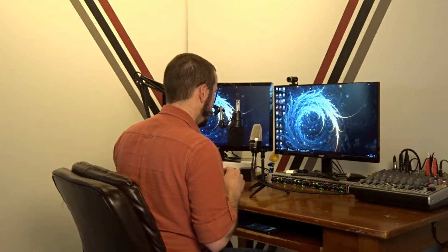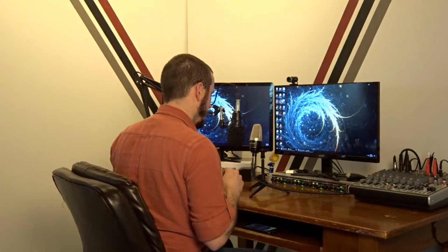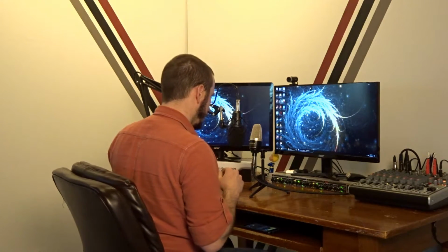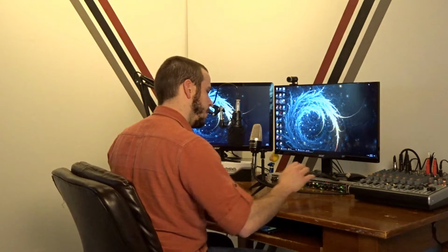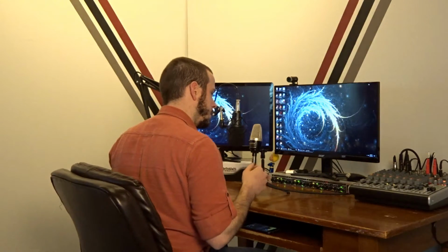We've got the expander set to 25-30 decibels in terms of when it starts expanding. The compressor is at about a 2.5 ratio and also engages about where the expander lets off. Same settings for the 960, so let's listen to the 960. And so here's the 960 with dynamics processing.